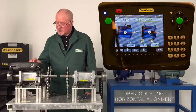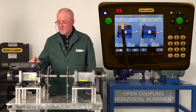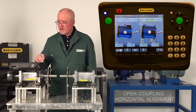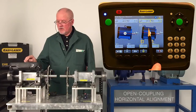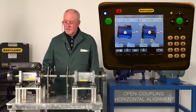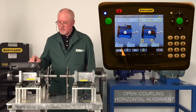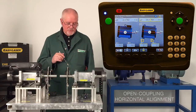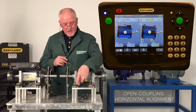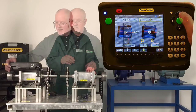On the left side of the screen it's the vertical plane: four thou of offset and an angle of one and a half thou per inch. On the other side we have 26 and a half thou of offset — which is a lot — and negative four thou per inch angular. Looking at the correction arrows, it's skewed, so we have to make a correction. However, it's showing positive, meaning we have to remove shims — but we can't: we're at three thou here, nothing on this side, seven thou and nothing at the back. We're basebound, so we can't go down.